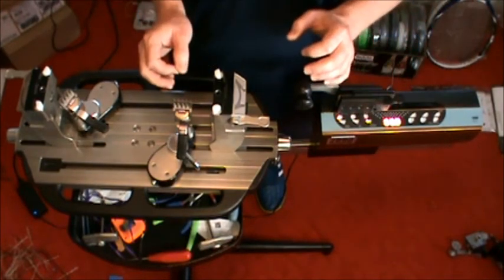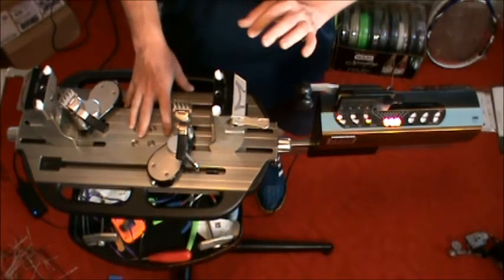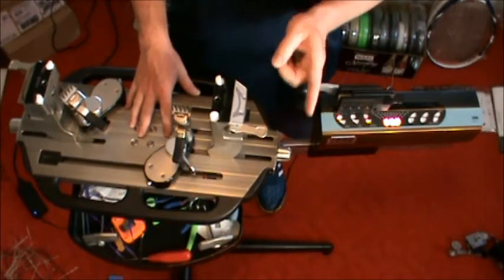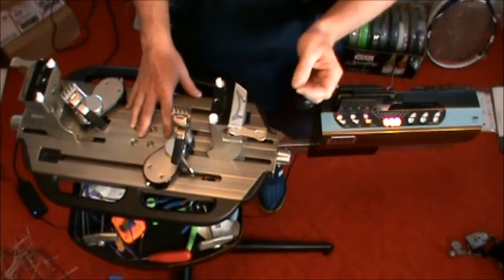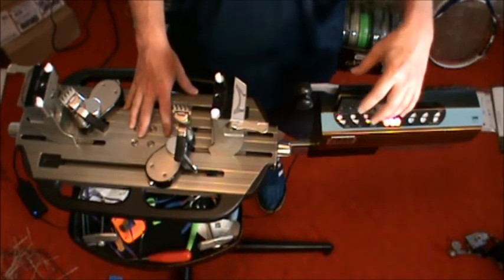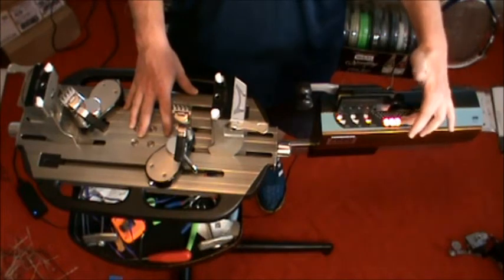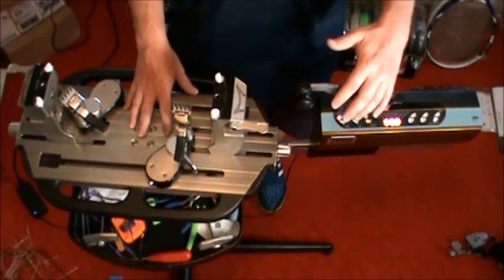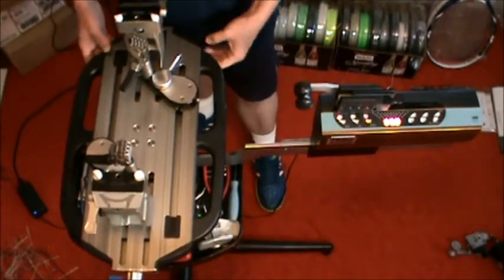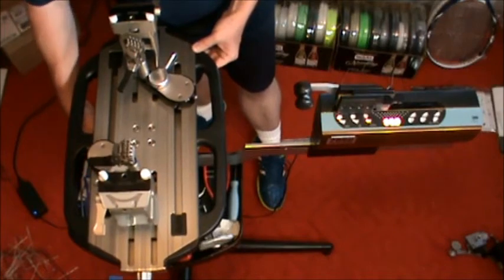So I'm just going to show you a quick example of how to set up the turntable for when you are using the calibrator, but I'm just going to use a regular piece of synthetic gut string as well as a piece of polyester string to show you the difference between how electronic constant pull or any kind of constant pull behaves versus a lockout where the tension will drop. So you want to turn your turntable sideways, and if you have a turntable lock, it's a good idea to lock it.